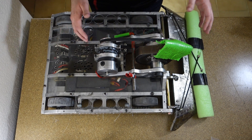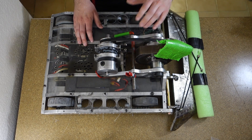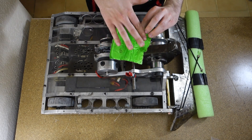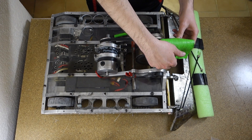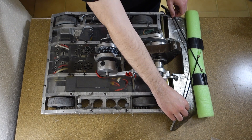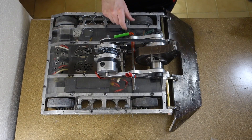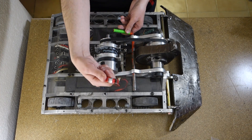Right now I've got all the safety covers on it — keep off the sharp edges, make sure it doesn't spin, all that kind of stuff. This is the blade cover; it's just a couple layers of foam with a few magnets in it and some duct tape so it sticks to the blade. The wedge cover is just a pool noodle with some bungee cords in it to keep that sharp edge from hurting anybody. And this is the weapon stop — just a half-inch steel bar with a little clip to keep it from falling out.